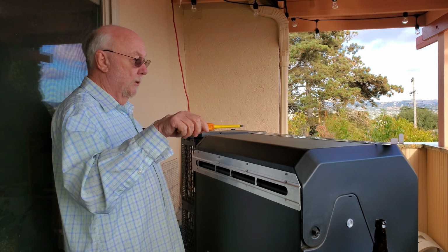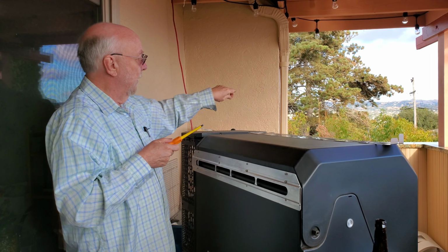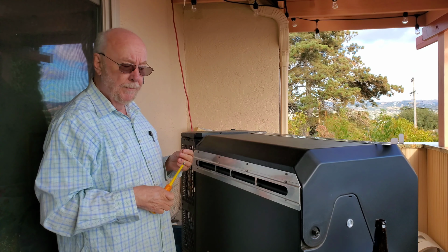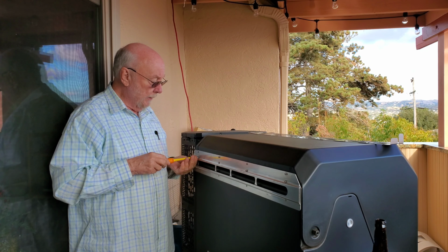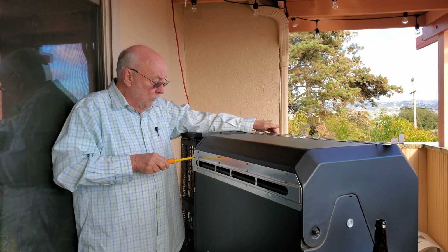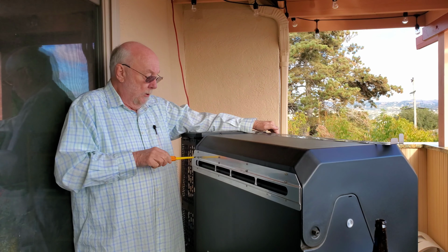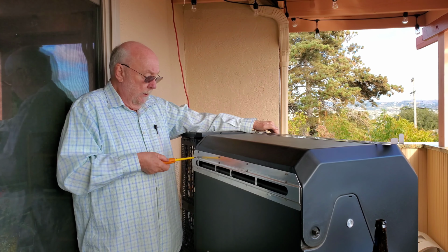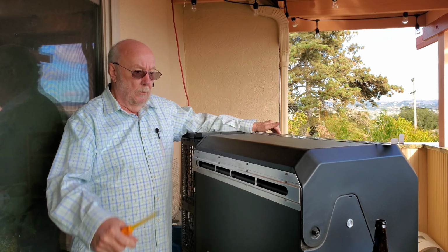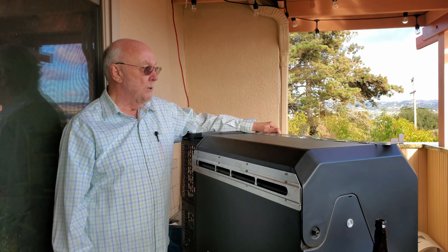Back, and this is going to get turned 180 degrees and over into that corner where there's sort of a cutout for it, and this side here will be exposed to the weather. And I'm looking at the idea that we do get some sideways rain depending on which storm is coming through. And I wouldn't mind being able to just close the vent with the cast iron grates in there. I don't want to build up any rust, so being able to close the vent is important. So I'm going to say 80%, that's the reason why I'm putting this on there.